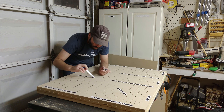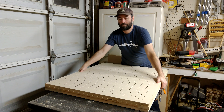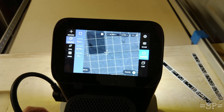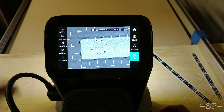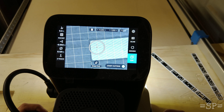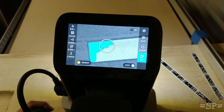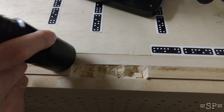Normally the Shaper tape comes off pretty easily, but I had left mine sit for a number of days — probably at least a week — and that made it a little stickier to get off. Since I hadn't planned ahead and left a hole for the vacuum to pull in from, I went ahead and used the Origin to cut out a square that was just the right size to go in from the side and have my vacuum pull in. The on-tool mode actually allows you to draw shapes, so I was able to scan in the edge of the table, draw a rectangle that I wanted, and then cut out the shape.